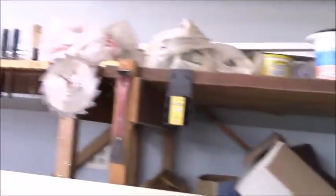The tool I'm going to use — I inherited this from my dad — it's a Red Devil tool. It's got a chisel-type scraper on one end, but what's really great is this hook scraper. See, I can draw this across that glue and pull it off — just one pass really.